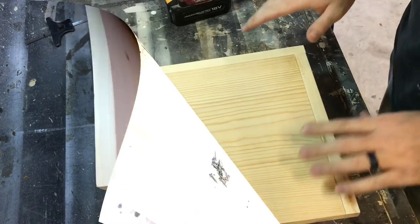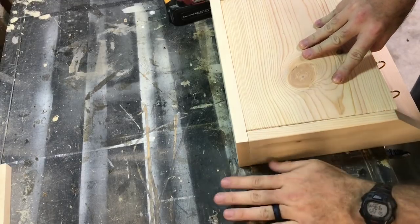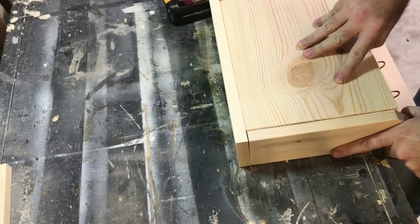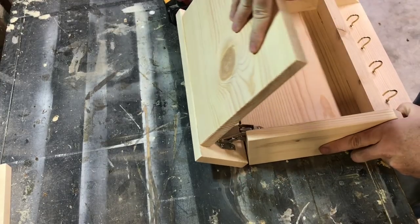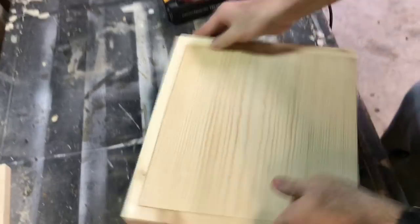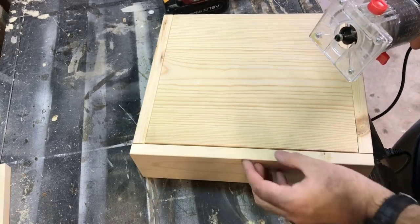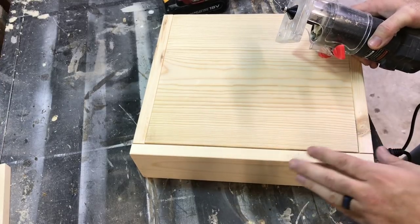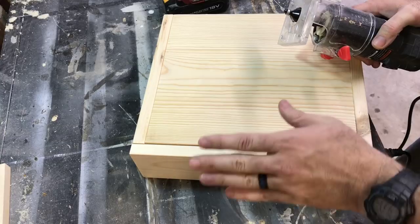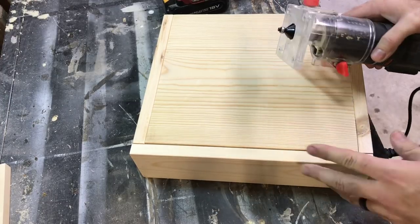Now I've got the box together. If the workbench is the wall - when you lift the lid, this corner hits and it's actually lifting it up off the wall. So what I'm doing now is taking a quarter-inch chamfer bit and just running over here to knock that edge off. That way it makes it nice and smooth. I'll hit it with the chamfer, then take my sander and smooth it out - it actually makes it look round. When this piece opens, you don't have to worry about it hitting your wall and scarring your sheetrock.